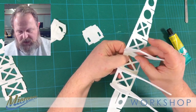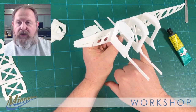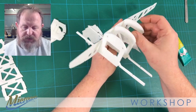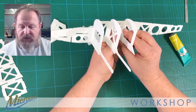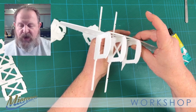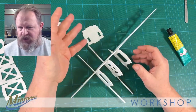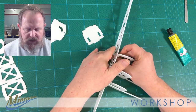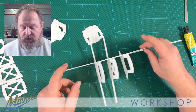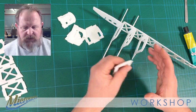And the reason that I have this rule of having the part number, where the part number is etched facing forward, is simply because when a laser cuts something, the focus of the laser is on the surface of the material. So as it goes through the material, the laser loses energy, and the energy spreads out. If you flip over anything that you've cut, especially foam, which cuts so easily, the cut usually removes more material the further it goes through the material, and that means you get a slight angle to the cut.